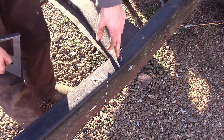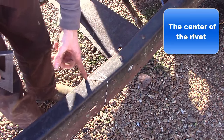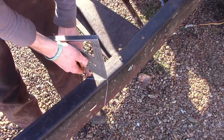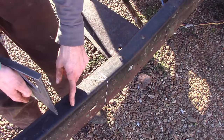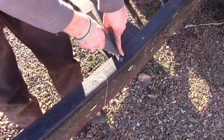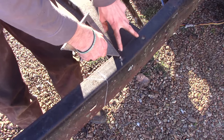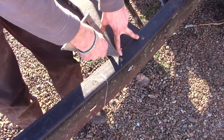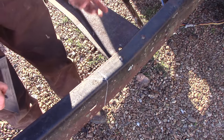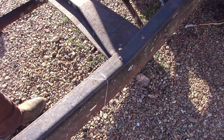All I did was I measured off this rivet right here 4 inches back and then marked a 45 degree line on it and did the same thing on the bottom. As far as we'll notch in, we'll cut into here and do the same thing on the bottom. And this is only 3/16 plate, so it should have been real easy. The reason I went off this rivet, a lot of times on frames, especially on trucks, if they drilled the holes, they probably drilled them before they bent all the angles and everything, so it's probably a real precise layout wherever they put that. So it's just as good right here as it is on the other side of the frame. So, just a reference.